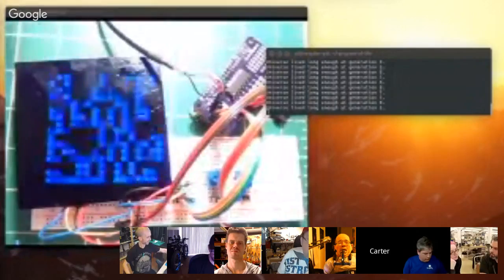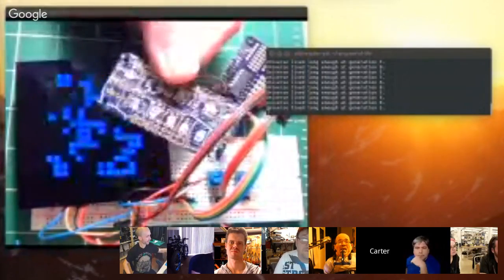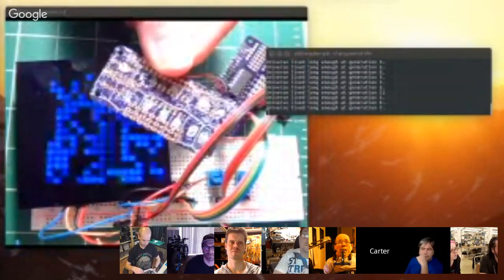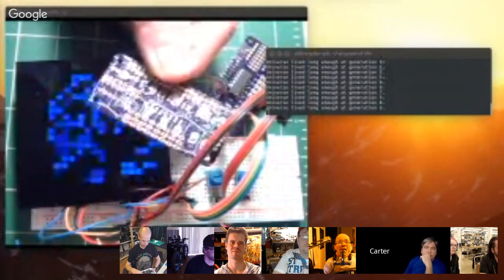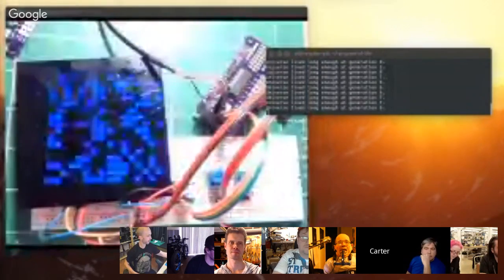Yeah, and it was kind of interesting too. One thing I did on this was play around with silk screen. On the back of it, I made cells, since it's about game of life and cells and stuff like that. This end result I didn't really like. That blotchy white silk screen was very distracting when I was trying to solder. So I've made a rev of that.